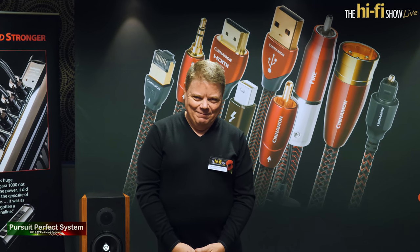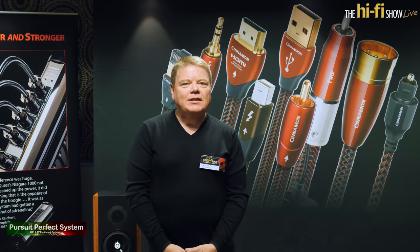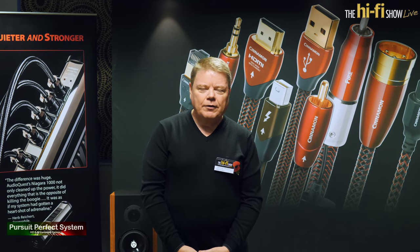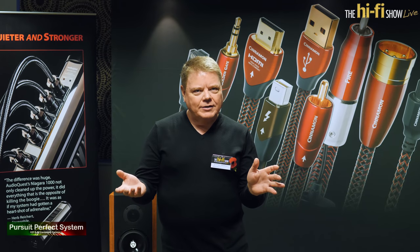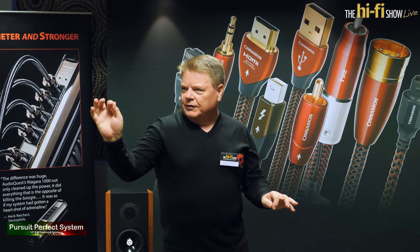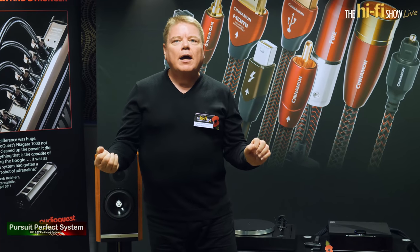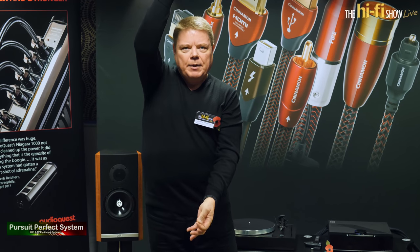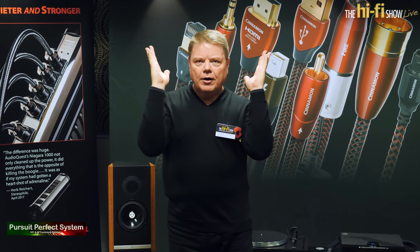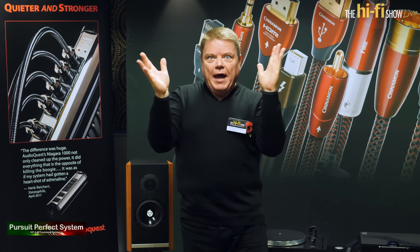Just seems like we did. And the reason for that is that when you listen to volume, you're not listening to sine waves, you're not listening to sine tones, unless you're listening to a pipe organ. Other than that, you're listening to the transients, whether it be from percussion, like the strike of a snare drum, bam, or that of a cymbal, ting, or the plectrum from a string, gling. And that is a peak-to-peak voltage swing in electronics that's very fast and immediate, and our ear responds to it instantly. That's what grabs us, that's what wakes us up, that's what gives it that attention.